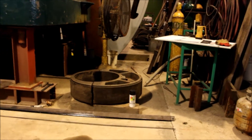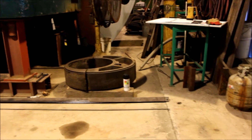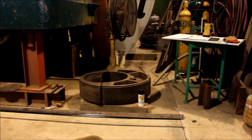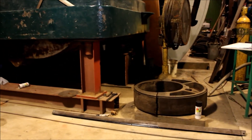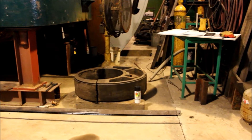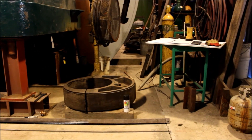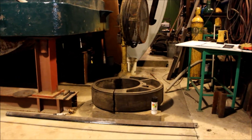Both sides of the engine don't want to settle unevenly. The problem we have with this engine is we've got this giant 20 foot flywheel just cutting a slice right down the middle of the foundation. If not for the flywheel, this would be very easy to do. But since we have a flywheel, basically a 3 foot by 20 foot slice is taken out of the middle of this foundation and we've got to work around it.